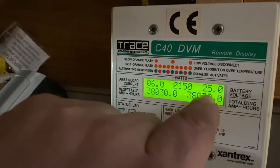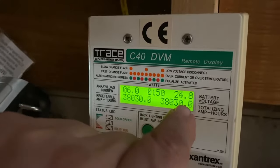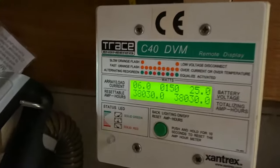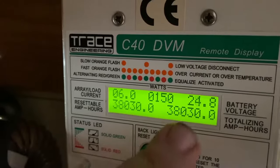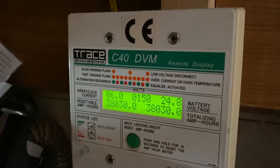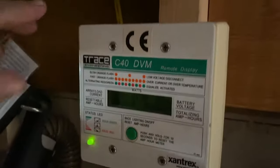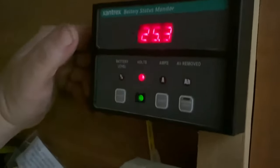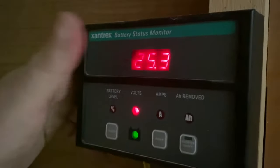At the same time, you'll see those numbers — like with his 13.9 volts — you'll see it go from 13.1 all the way to 13.9, then 13.2, 13.3. There's a reason for that, although it looks bad and it makes you want to panic. You have three stages of charging, and those are regulated by your charge controller for the most part.